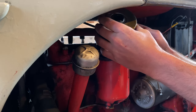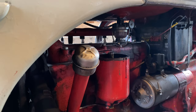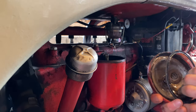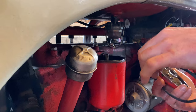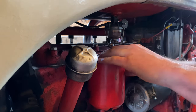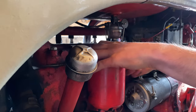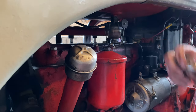Try to keep as much oil inside that little basket as we can. I'll put the old filter down in the box that came with the new one. On the inside of the lid there's a gasket around the outside, so we're going to pull that off and replace it with a brand new one. Got the brand new gasket here — just get a little bit of oil and oil up that gasket. Now we'll get the new filter installed, nice and neat, with the handle on top so next time it's super easy to replace. Got the new gasket installed on the cover and we'll put the bolt back in — nice and snug.